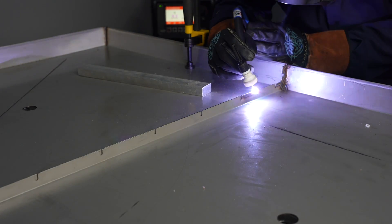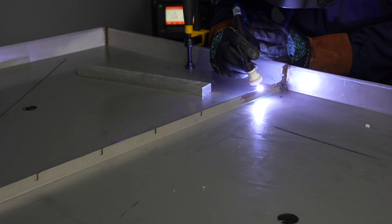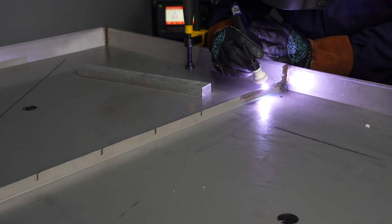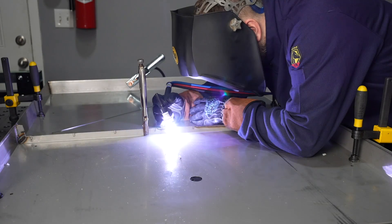I started with the low-speed pulse at about one pulse per second and the high speed at 120 Hz, and it progressed along pretty well. It was working all right but I felt like I was putting a little too much heat into the material based on the color afterwards.